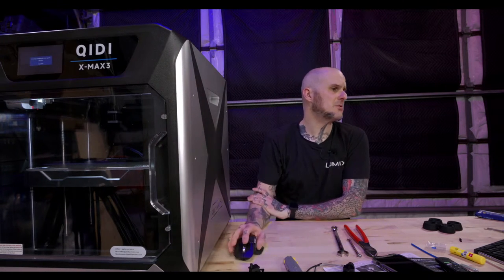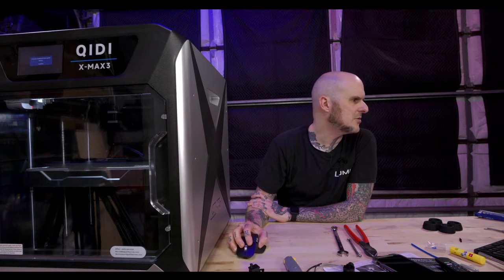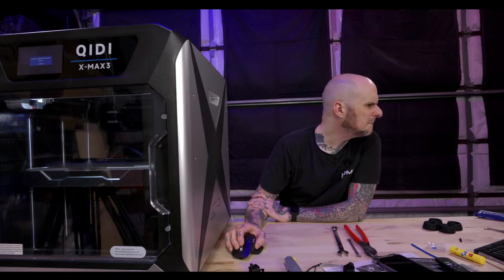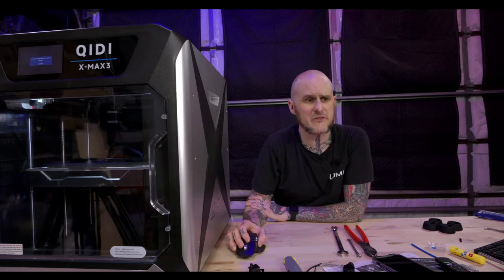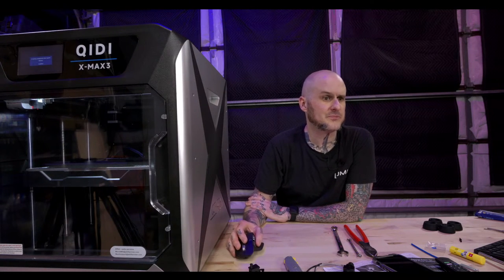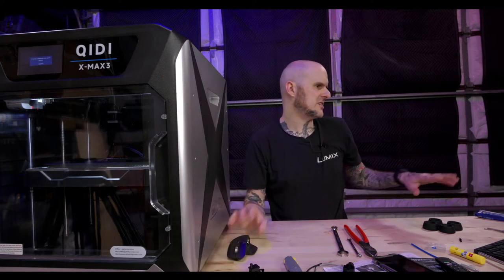Could you check what max chamber temp is set to? Sure. I will look in the config. I didn't take note of that when we were there. They say 65 in their marketing material, so I just assumed, but it might not be. Generic heater, hot. Max temp, 70. It's set to 70. Max chamber temp is set to 70. So, yeah. We're up to 57 Celsius now.